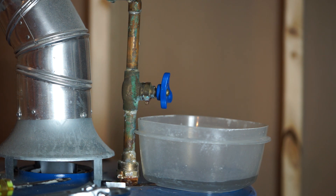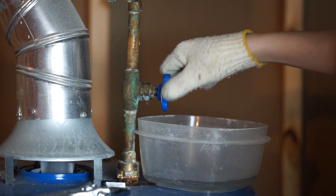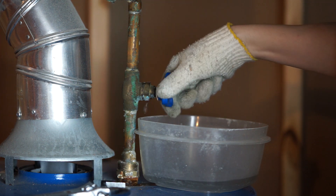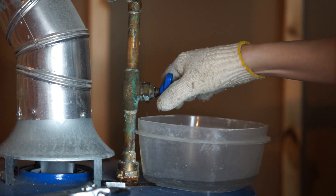I have here a water intake valve that's dripping at the stem. The quickest way to fix this is to shut off the water main and then counterclockwise turn the handle until it's open to the maximum, and then tighten it a little bit more. It feels like you're over-tightening it, but that's what is needed to give it a seal.